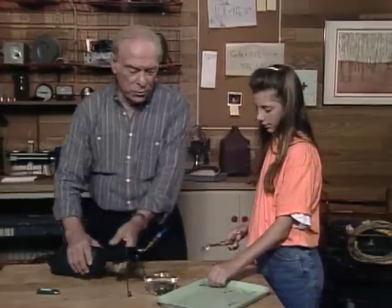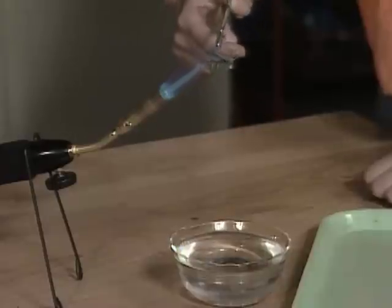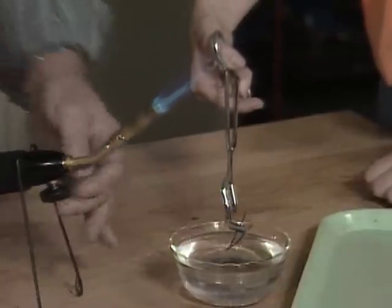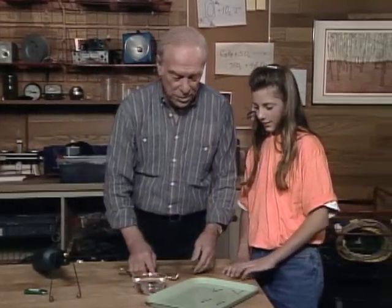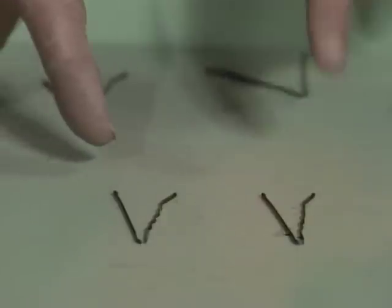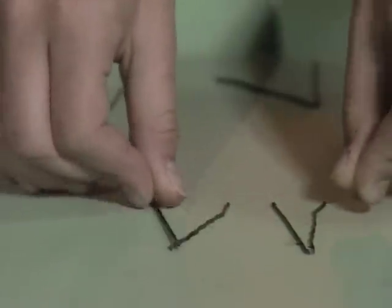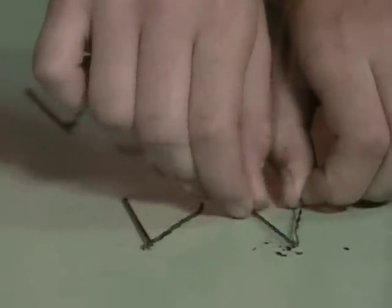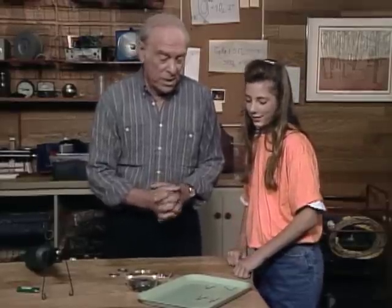This one you're going to plunge into the water as soon as you get it nice and red hot. There you go — put that one over there next to it. According to the theory, this one will break and that one won't. Try it — it did break! And this one better not break. Some little chips are breaking off because we oxidized the surface by heating it. So now you are a metallurgist!